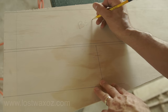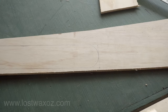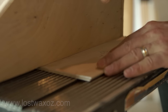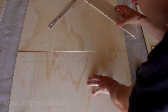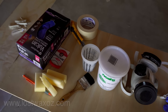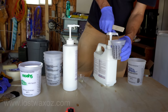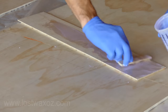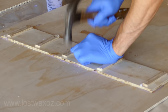From the wood left over I cut three butt straps and two skeg doublers. I made one end of my skeg doublers nice and round by tracing around a can, cut the other end so it would fit right up in the center, and routered the edges to make everything look pretty. A giant thanks to Noah's Marine who supplied me with all the epoxy products I used. I prepared by covering some sticks with tape, pounding nails into them, and pounding nails through my canoe to hold the two halves in place. I mixed up some epoxy according to the directions and added cotton fiber until the epoxy was the consistency of honey, then spread it all over my butt strap and put it into place, temporarily holding it down with my tape-covered wood strips. I glued the butt straps for the sides the same way.